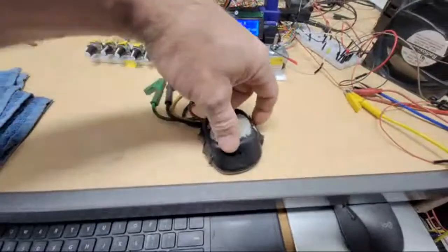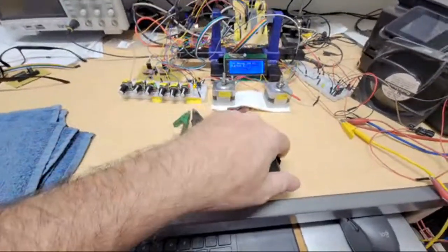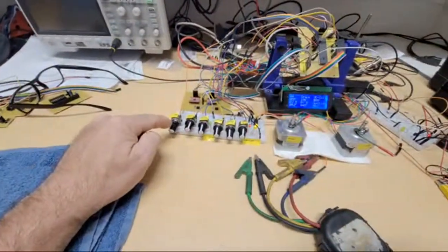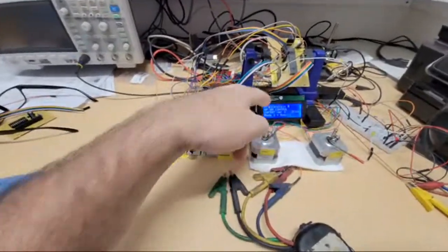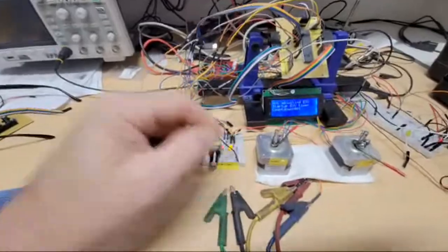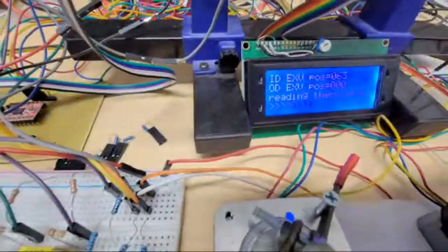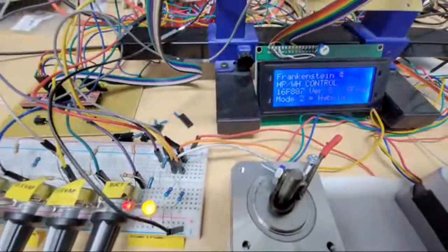And if I turn off my AC, or the other way around, the water heater. So the AC's calling, not the water heater because it's off, but the water heater's cold. It's still going to be in hybrid, so still mode 2 hybrid. This probably isn't coming through because of the live stream, but right, because my water heater's cold.